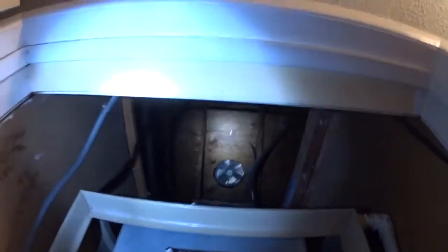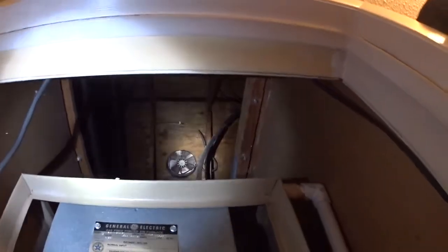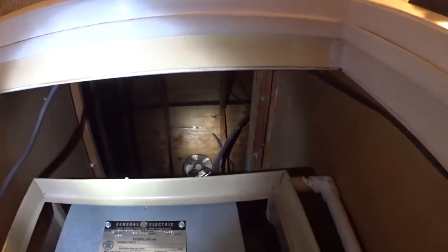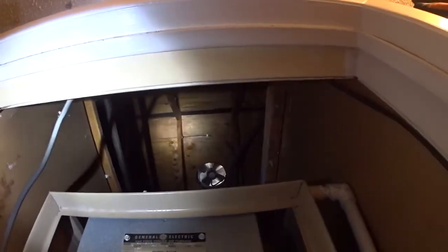Oh, I can see the attic. Got the coil and the plenum out through the top. Gonna drop the furnace out of the closet and then bring the coil and plenum back down through this hole. Probably take the new furnace up through this hole, and then we'll close the hole in and run a piece of flex through it to tie into the return that used to be under the closet.